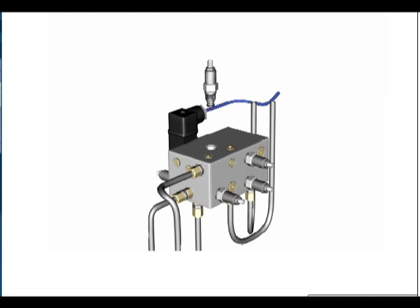They are a very compact design that must be installed into special cavities in valve blocks or manifolds. Cartridge valves, used in combination with a manifold, can be used to create a common circuit free of potential leaks associated with external plumbing. Cartridge valves can be divided into 2 design categories, screw-in and slip-in.